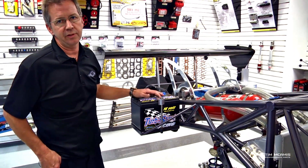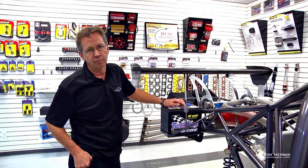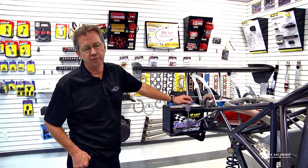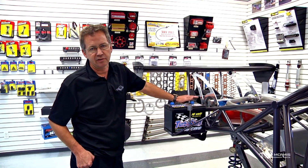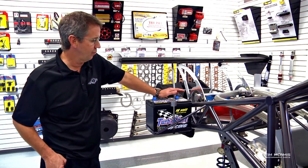You need to keep the batteries charged up — that's one of the big things over the winter. Throw a charger on the batteries every couple of weeks to keep them hot. A lot of battery chargers now are maintenance-type chargers that will charge the battery up to full capacity and then float it at that capacity, keeping it fully charged all the time.